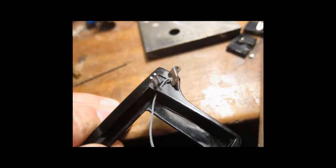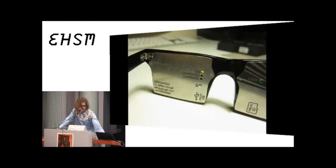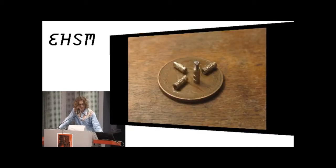These glasses also have a radio communication link, and the antenna is the little stiffening rod in the glasses arm — a nice little touch making extra use of it. That's what the hinges look like after they've been riveted in place. The final step was making these little steel back plates to protect the electronics from the back — these are screwed onto the plastic frame. I drew them in Inkscape, printed it out, glued it on, cut it out with the saw, double-sided taped two together to make two identical ones. Then I used my laser cutter and a magic spray paint marking compound called Thermark — you spray it on, laser engrave it, and where you laser it, it melts and bonds into the surface of the metal giving amazing high-resolution black and white imagery. You can't scratch it off easily — it's incredibly resilient, much better than paint.